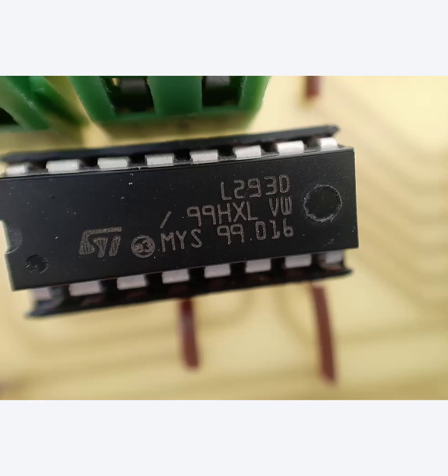On the L293D motor driver chips that we use, the D stands for diode. This means that the chip has flyback diodes built into it to suppress the electromagnetic interference generated by the motor.